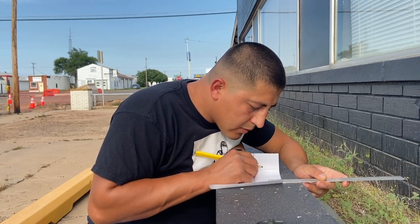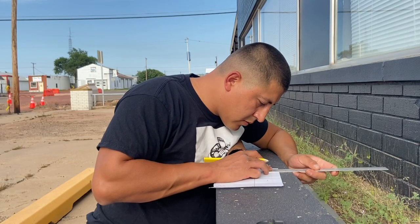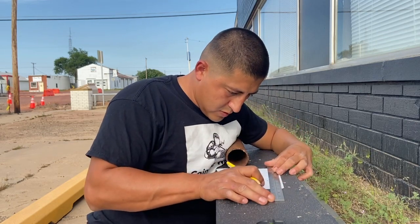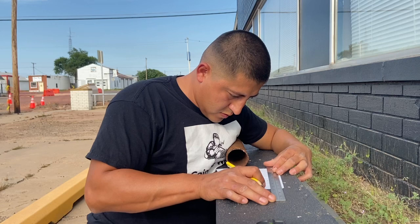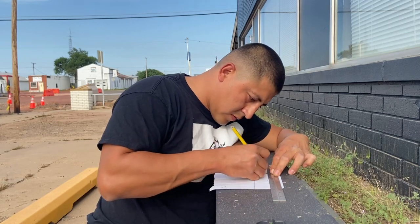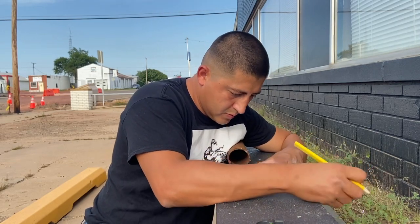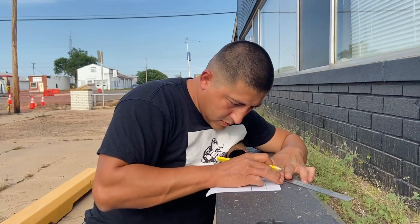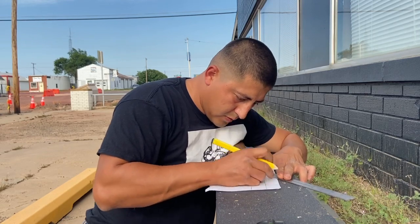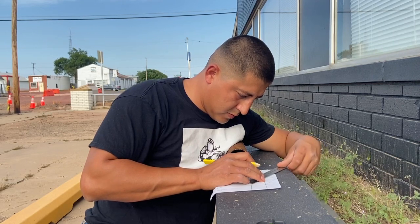You'll see what I mean right now. Don't get frustrated if you don't get it on your first try — it took me a few times to master it. Once you get it, you'll be able to notch or cut pipe at any given degree. I'll show you how to do 45s, 90s, and how to notch corners perfectly. I'm tracing the folds from the corners to the dots, and then I'll cut the template. That's pretty much making the template, which I'll trace onto my pipe and cut with my grinder.